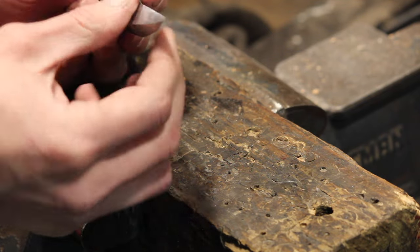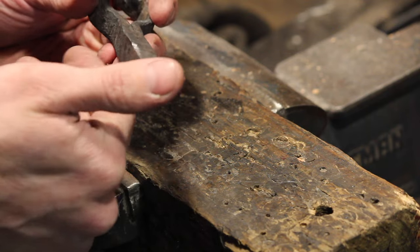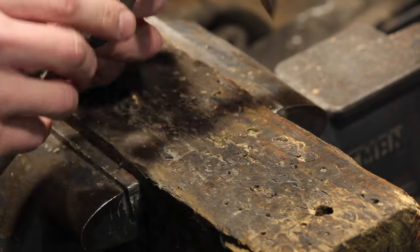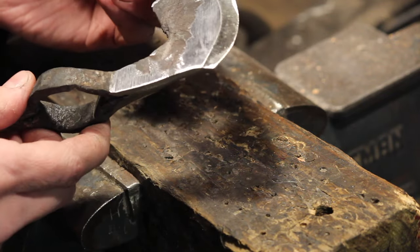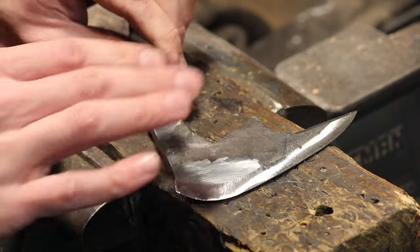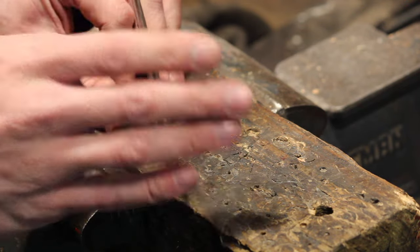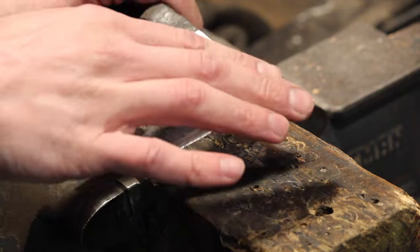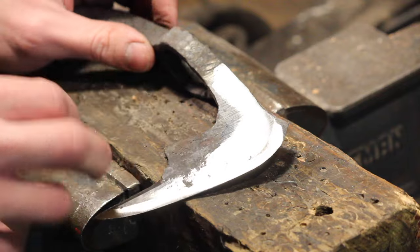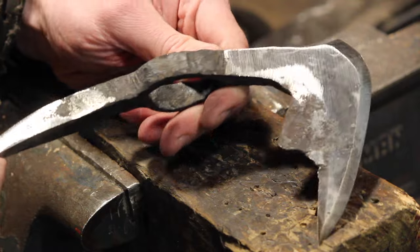I got the spike ground down to a nice chisel point, so that's actually got a good prick to it. I'm not too worried about grinding it a bunch and making it all perfect and pretty right now - I'm going to quench the head. I want to leave this blackened and obviously we'll re-grind the edge after. I don't want to make it too sharp because I don't want to risk melting or deforming the edge. We're good enough to go right now - I might try to clean off this fire scale just to see how it looks underneath, but we're pretty much good to go.